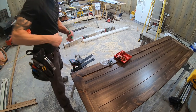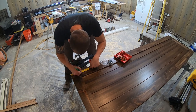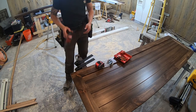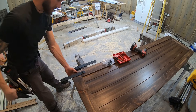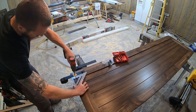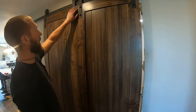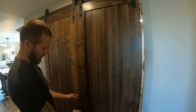Per the instructions on this door, you come down 5-1/8" from the top of the door, then mark the center. My stile is four inches so I come in at two inches. I drill a pilot hole, the nut goes in the front, hand-tighten, and square it up off the top of the door. Tighten it up using your square to keep it true. Once you get your doors hung up and everything done, you may have to do some minor adjusting to get your reveals right.